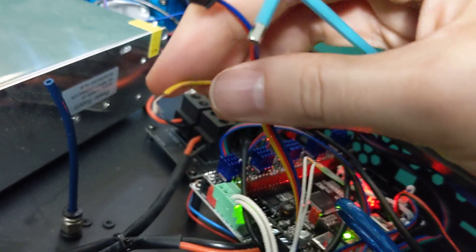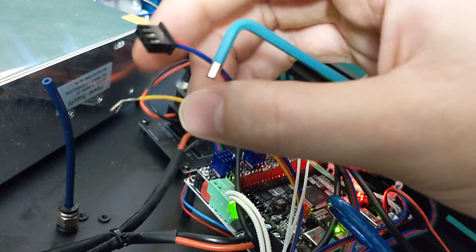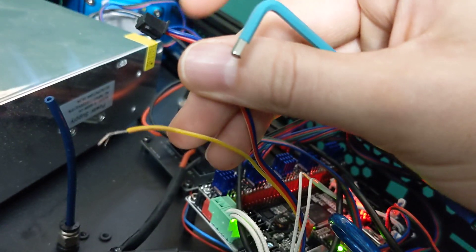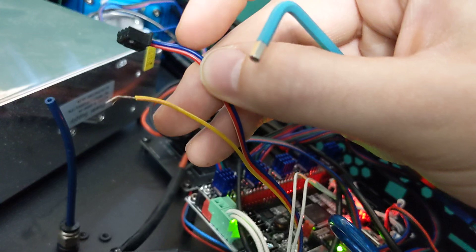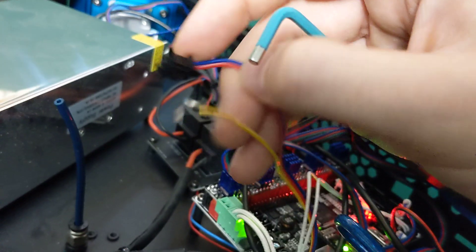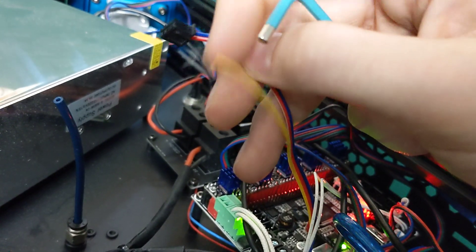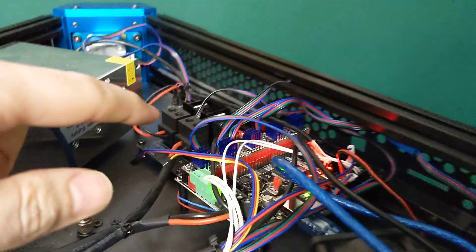The only addition I'm gonna have to do here is the fans. The hot end fan and the layer cooling fan share a power cable — both run off this yellow power cable, and then these are the actual different control pins. The blue wire is for the hot end cooling fan and the red wire is for the layer cooling fan. I'm gonna have to unpin this and make two separate pins with a shared power so that I can control that independently in Klipper.